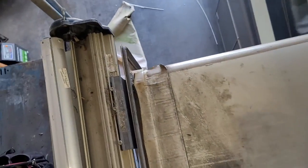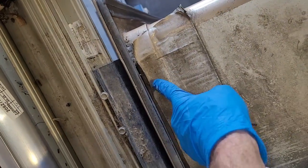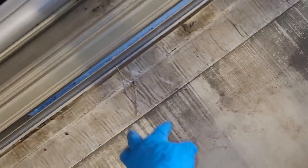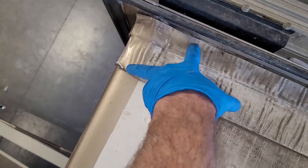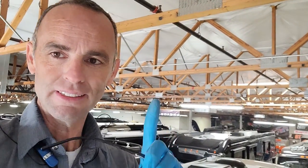That wasn't too difficult. Now I'm not looking for anything, but it's not a bad idea to go ahead and inspect the roof at this point. You can see my nemesis with the seam tape — it persists. I know this isn't the ideal tape; this is what the factory used. Everything looks okay — that can be repaired right there without the topper being off. We just want to make sure anything in the middle is okay. If it was really bad in the middle we'd have to take the topper off, but at least we can note that so the customer would know.